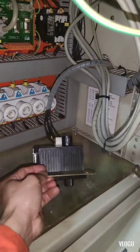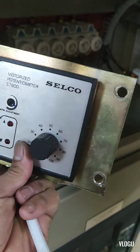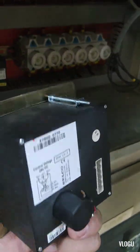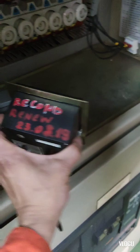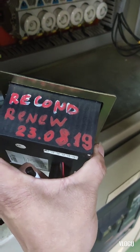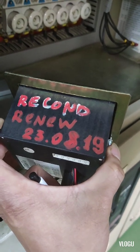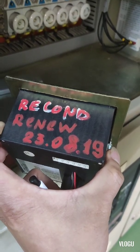I think the problem is this motorized potentiometer, but the problem is I don't have a spare on board of this Selco motorized potentiometer E7800 RPM adjustment. Here we have a 'recondition' remark on it, so I think this one is damaged — same history as before, they tried to recondition it because there was no spare on board. Now I need to do something to prove that the problem is this motorized potentiometer.